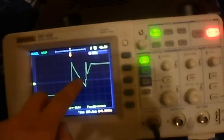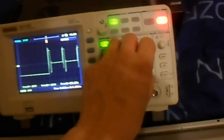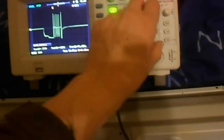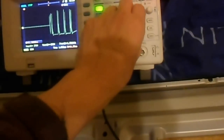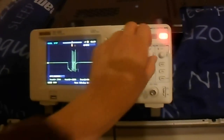If we zoom in here, we get V-setup ramps — this is just the panel trying to prime itself, ready to emit light. We also see the start of a sustain phase, but the TV quickly aborts it because it detects the X-Main is not functioning properly. Since we see this waveform, the Y-Main is almost certainly good.